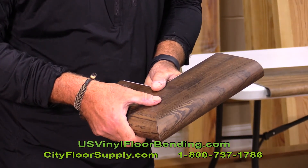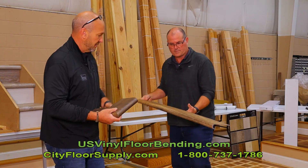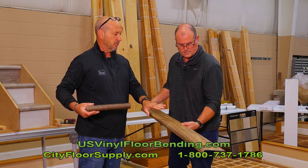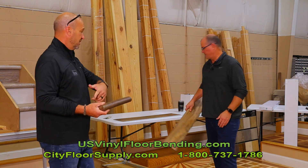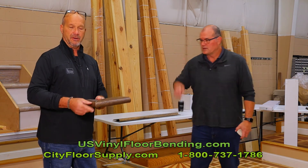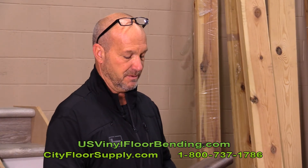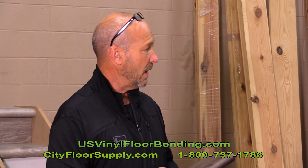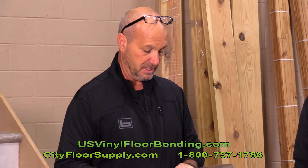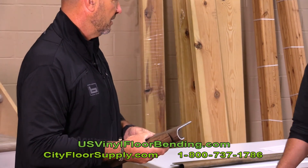You can miter this stuff — cut the front of the tread off and miter it. It's going to take a skilled technician to do the return on this. We'll have a couple other videos in the future, and there's going to be a display with a return step on it to show. One of the problems with this vinyl planking — unlike hardwood floor guys — if you cut a miter and it's a degree out, you can't do a little sanding, filling, or touching up. We've tried seam sealers. Some of the markers or wax pens work if you're a little out, but you have to touch that edge up. You have to be more precise with your cuts. But yes, you can do open steps — we just did a couple of sets through our business and it turned out really well.